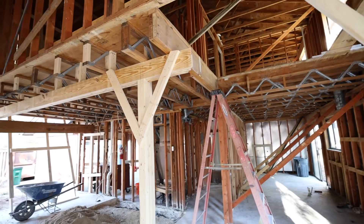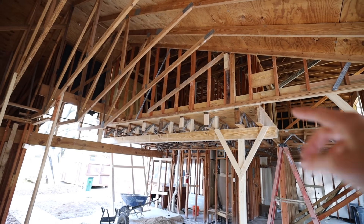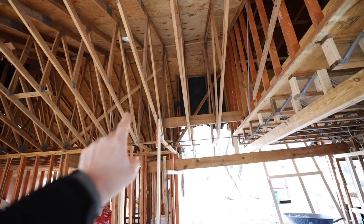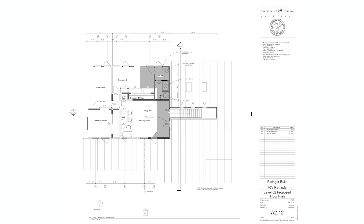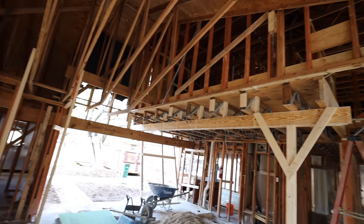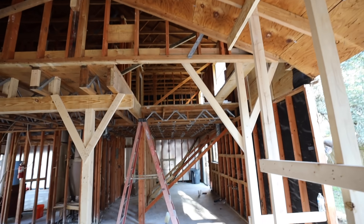As we've decided to turn this into my house and not a rental house, we wanted to add some space upstairs. We're framed with trusses right here, and I want to extend this floor line by six feet. These trusses are on two-foot centers — two, four, six feet. Where that temporary two-by-four is coming down, we've dug a big hole. My engineer has specified a footer right there, and we're going to put a steel beam there. We're going to add a steel beam across to support the trusses, frame out this wall, extend the upstairs roof, adding six feet to the whole upstairs — which gives my daughter a bigger bedroom and a full bathroom up there.